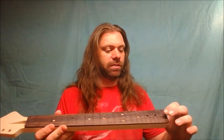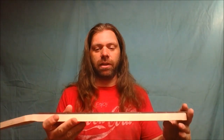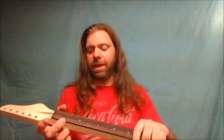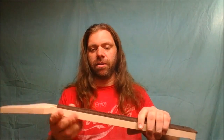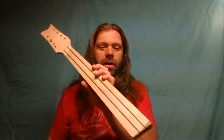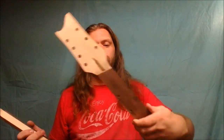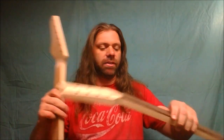The problem I have with doing this on these necks is that the fretboard is glued onto the maple. If I throw this in the oven for half an hour at 275, I'm thinking the glue is going to soften up underneath and the fretboard is going to start peeling off. I'm not sure, but it might. On this neck you've got a five-piece glued together, plus the fretboard glued on, plus the peghead glued on at a 15-degree angle — so there are a lot of glue joints on this one.